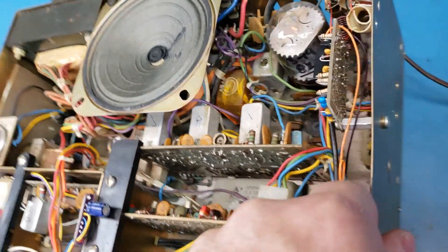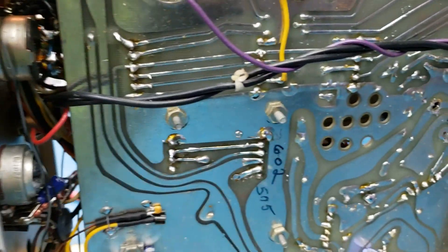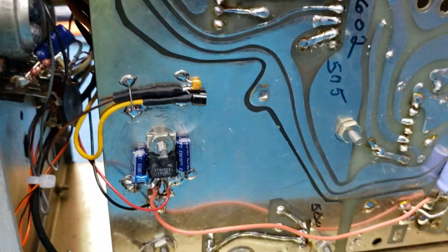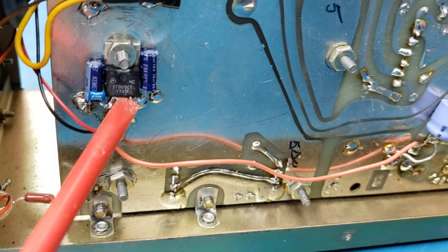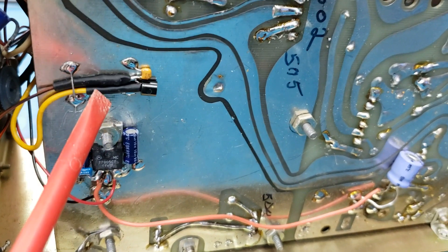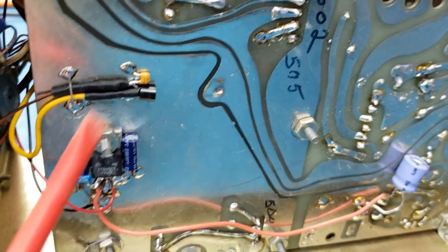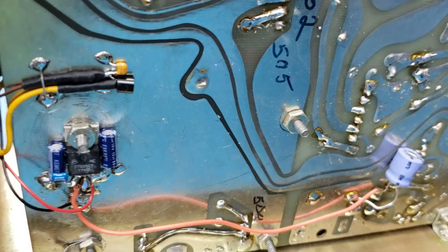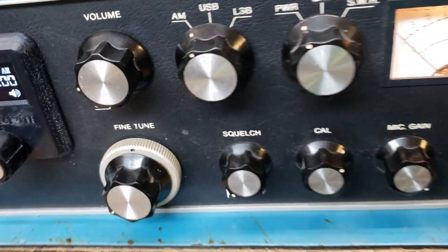What we did on this — because this old stuff ran on some voltages that weren't exactly 13.8 or 12 volts — to protect things, we'll make our own little power supply. This is the little 5-volt regulator. And this here is your keying transistor. The kit is in control of the transmit for things like Roger Beep, PTT delay, timeout timers, and all the things that it has.